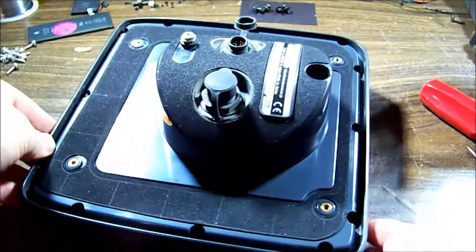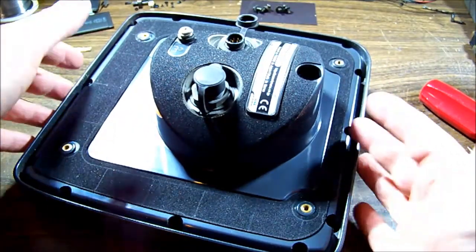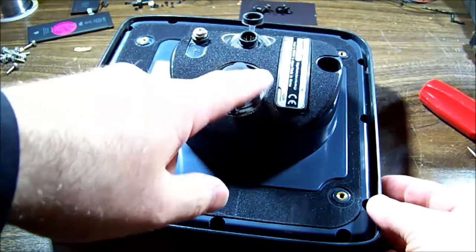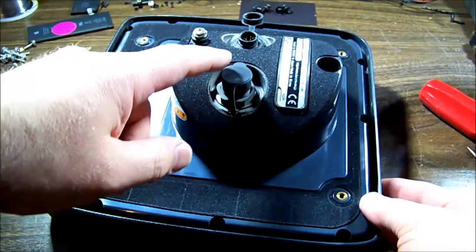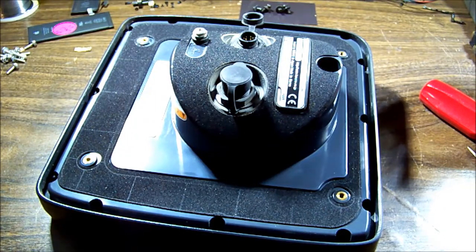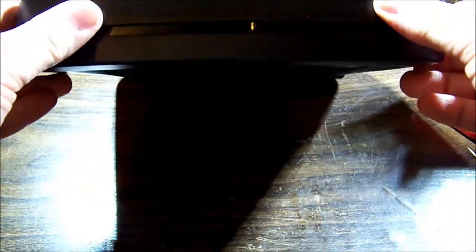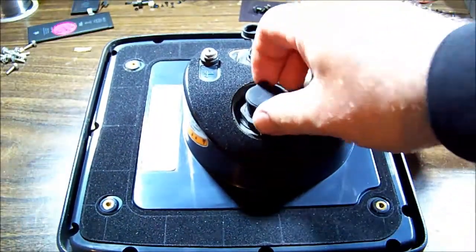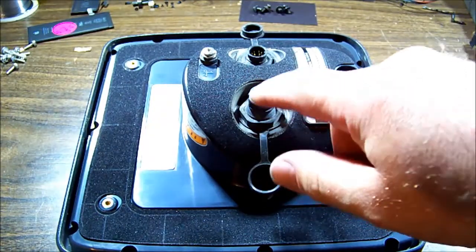It's separating along the edge - looks like the screen will be left behind from the back. There are connectors here and here, so there's probably some sort of flex down from the connector to the motherboard. We may need to undo the retaining nut so the connector can fall into the unit as we lift it off. It appears to be a plug with solid wires going up to the connector and it won't let go, so we'll have to remove the retaining nuts.